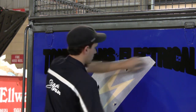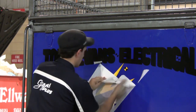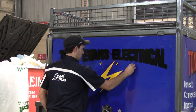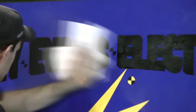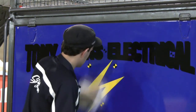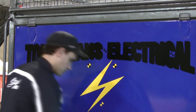Again, remove the application paper at an acute angle. Now it's a good idea to give it a quick clean because sometimes the vinyl has a contaminant on it which makes the second color not stick as well as it should. Just run over it with a bit of methylated spirits and that'll remove any contaminants that might be there.